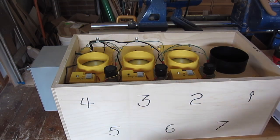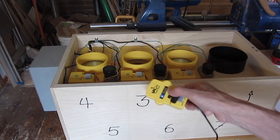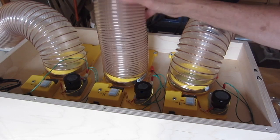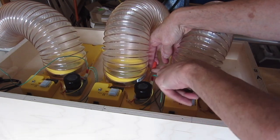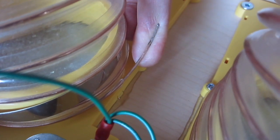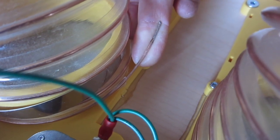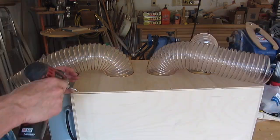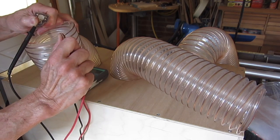I've numbered the blast gates according to the address that commands them to open, and it's a good idea to test each one to make sure all the dip switches are set correctly. With this sensor set to three, blast gate number three opened, and then when I go to off and wait 50 seconds, it will close. Three short hoses connected to the bottom gates of the manifold are secured with band clamps and the ground wire connected to the wire inside the ducting. I soldered the end of the wire after peeling back the plastic to give a clear electrical connection. I then did an electrical continuity check between the ground pin and the cable — looks good on all three.